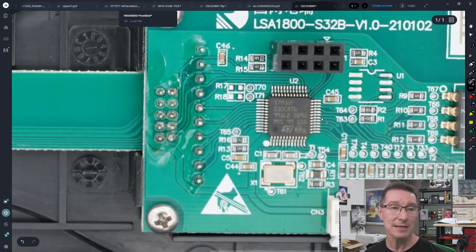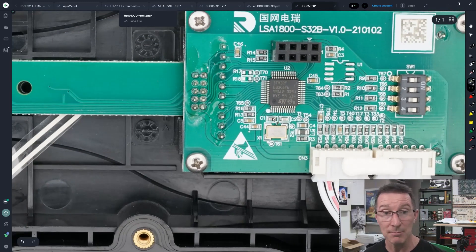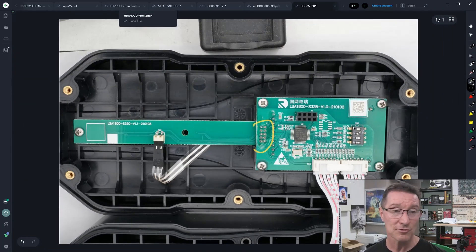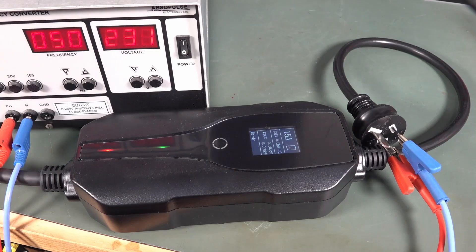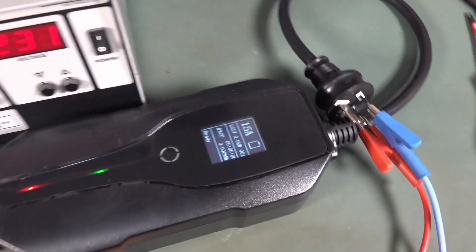The main board has an STM32 micro. Once again, a bit surprising that they didn't use some Asian-sourced micro — I guess they already had the development experience for the ST micro. This flat flex ribbon here is for the switch on the front panel. It's just got some LEDs there which connect through. These dip switches here, I would say, set the model and region because they sell these into different countries with different standards. As I said, this actual model is capable of 16 amps but they limit it to 15 amps here in Australia. Don't have a 15-amp outlet in the lab anymore — somebody took it out when they renovated while I rented the place out.